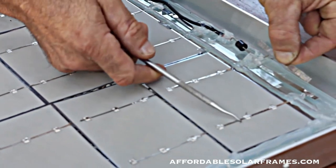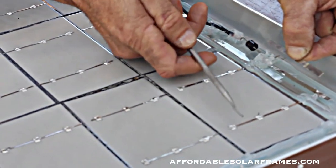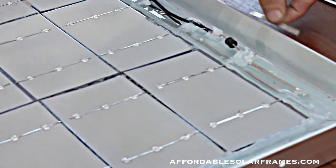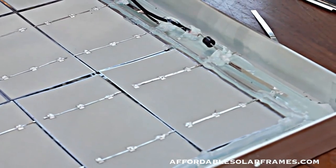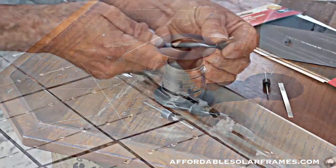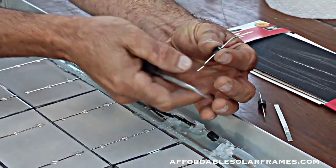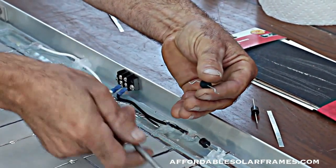The back side is positive and the front side is negative. I had to add this piece of tabbing wire, a little half piece, soldered into this bus, and we added a diode. Diodes come like that - I bend them to look like this. It's color coded: you got a little gray spot and a dark end. The little gray end will go towards the batteries and the big dark end will go to the cell.